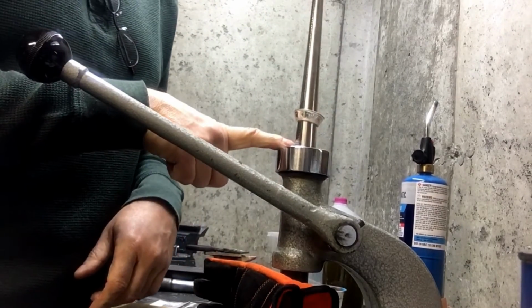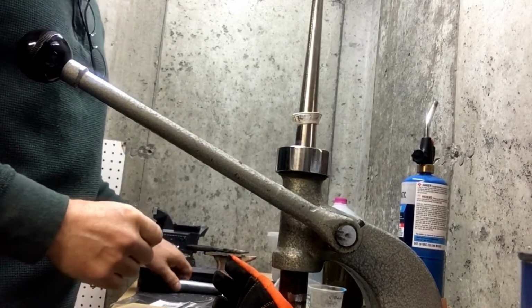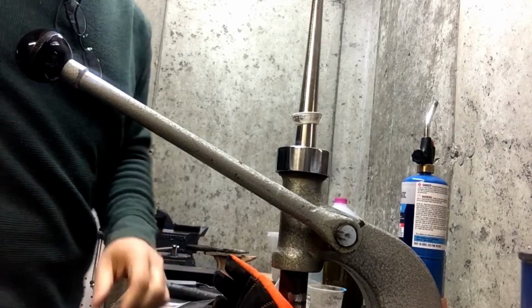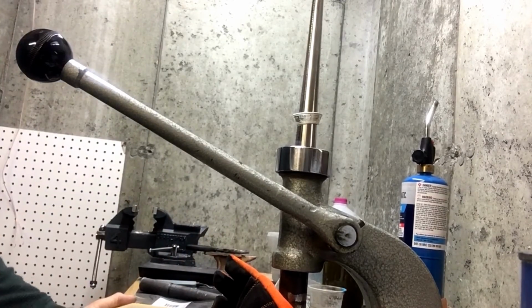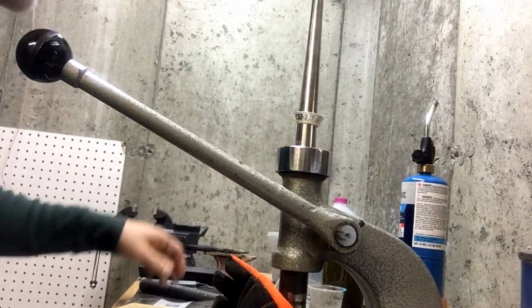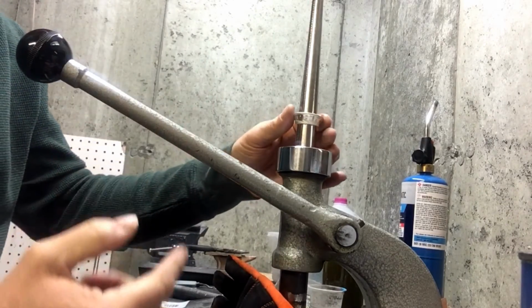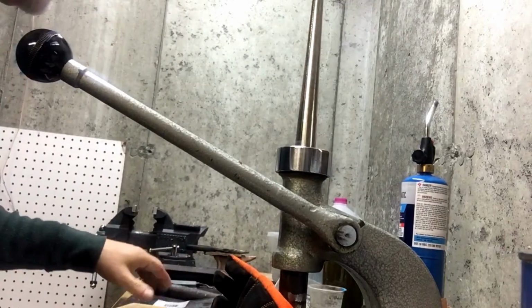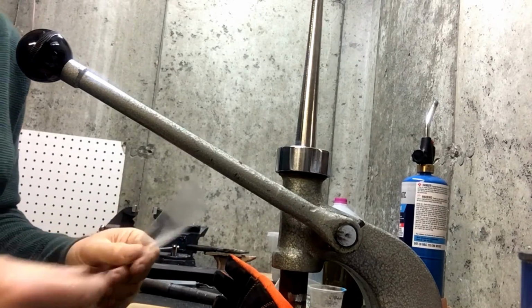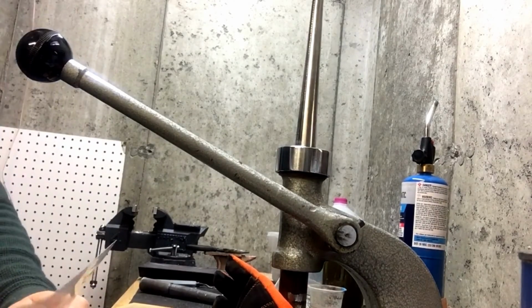I'm going to probably stretch it all the way to the bottom here, because that'll bring it up to a 14-ish. Then when I throw it on my real size mandrel, that'll probably be more like a 13. What I want to do though is preserve the inner detail. I don't want metal on metal contact here. So I'm going to wrap the ring stretcher with some clear plastic to take the brunt away from that. So I have this kind of clear cellophane that was on a greeting card of all things. And I will cut roughly a 6-inch strip.